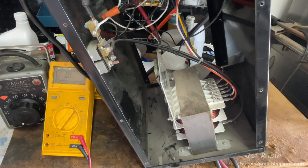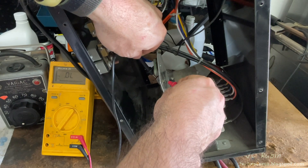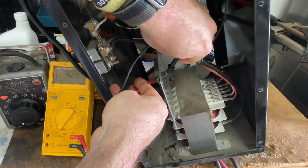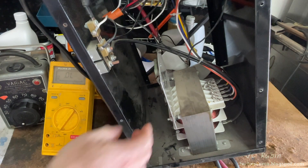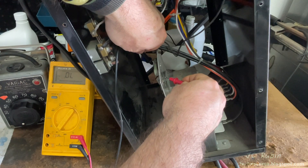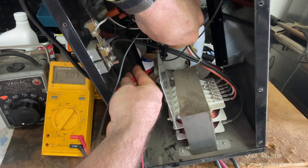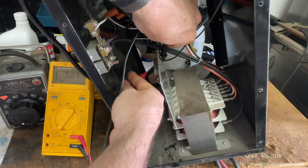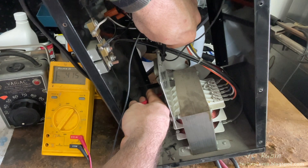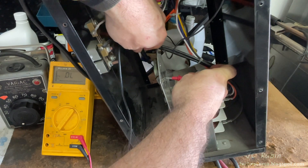Moving to the top one closest to me: open in this direction, and 0.420 in the other — not aligned with the first value, but acting as a diode, so we'll say that's okay. Next row: open in this direction, 0.507 in the other — working diode. The other two read 0.423 and 0.415. So all these diodes appear to be working; their values are all different, but they're working.